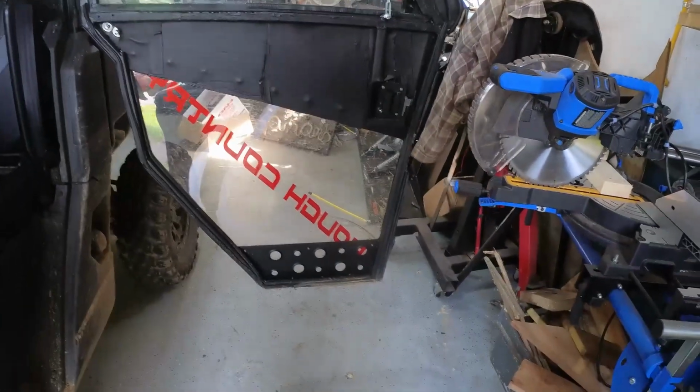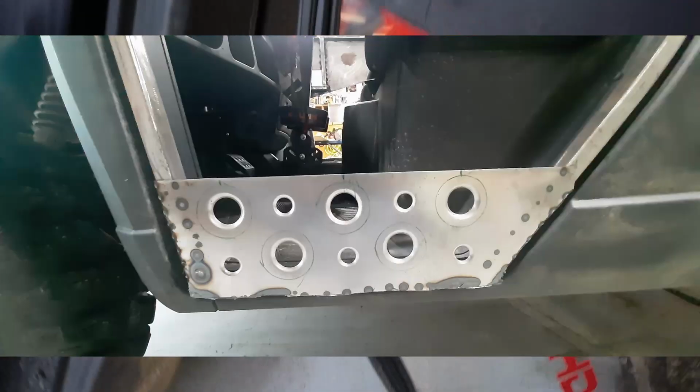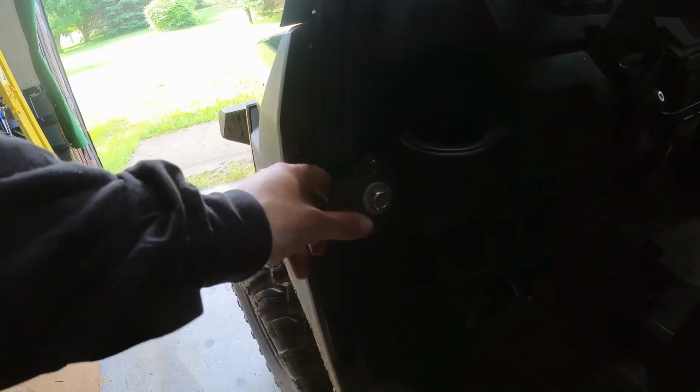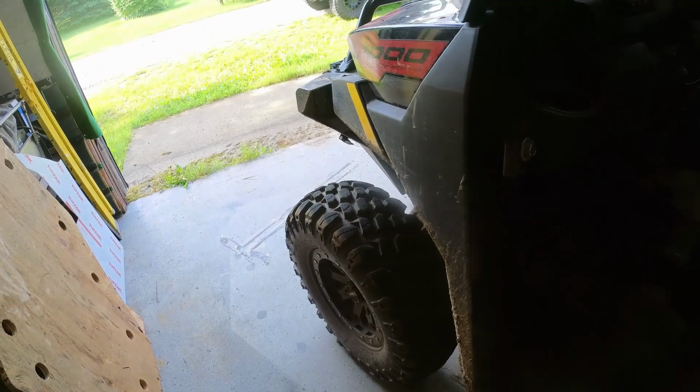There's the inside. I've got a sheet metal dimple plate down the bottom that the Lexan's over. I've got it all gusseted and weather stripped all the way around. I've got some that's 1 by 1 inch that fits in this inner channel that's in the roll tube. My latch is just a piece of plate bent over 90, but I have a dimple die within a dimple die, so I could rotate it up and down and slide. And it's just one bolt to attach it. Then the other two points go into the factory bolt holes for the netting.